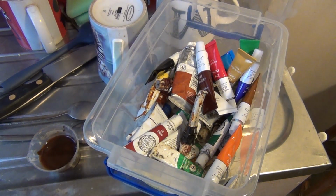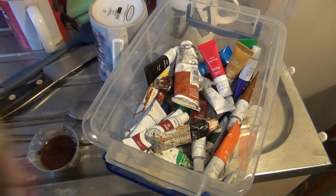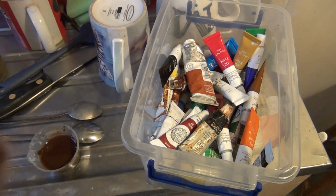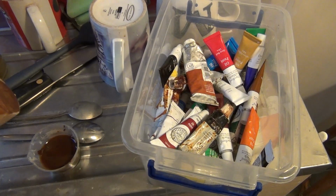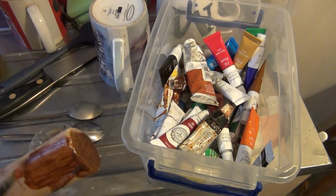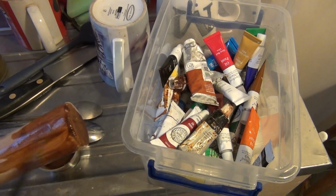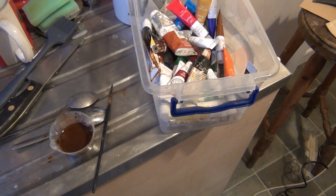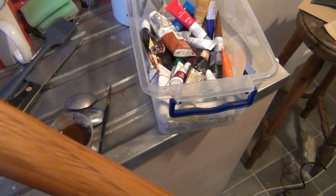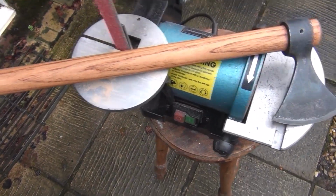As you'll know if you've ever bought any, wood stain is getting really expensive, so I made some out of bits of oil paint and some white spirit, and that's the colour it's coming out, so a few coats of that. Let's change the colour every so often as well. Add a bit of darker material in there, let it dry. I think that's going to look quite pretty. That's the colour it's gone now, which I think is a great improvement.